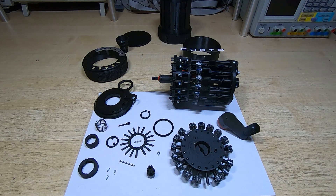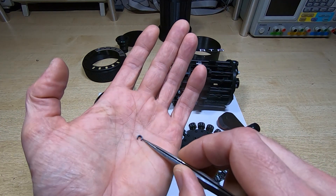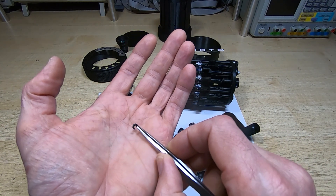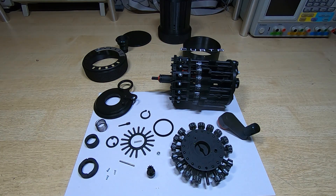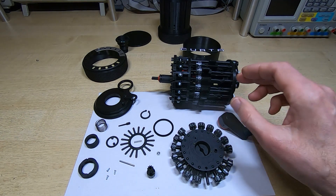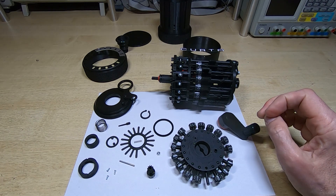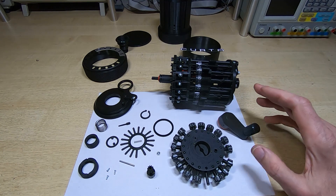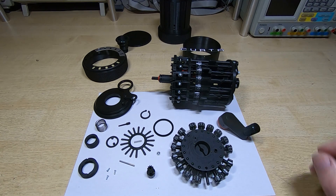Those are the only parts I used metal for — just the crank pin and the carry pins. Some of the other very small parts, like the clips used to hold the gears in place on the shafts, were 3D printed and turned out fine, although they're getting to the limit of what the printer can do at this nozzle size. I retained the 0.4mm nozzle for printing this. At some point I may go for a 0.2mm nozzle and try a one-to-one scale unit, which will bring a different set of challenges.